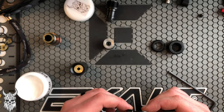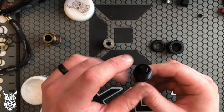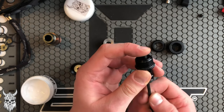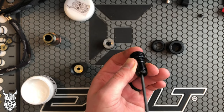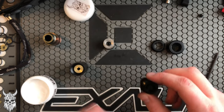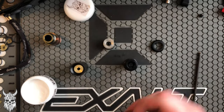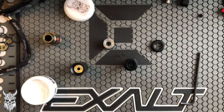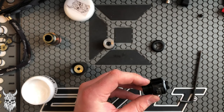And we'll put the adjuster back in the body. Let's drop that in. What you kind of need to do is hold even pressure here so the threads can catch correctly. There we go. I'm going to bring it just before flush. Should be 200-ish. These are adjusted in very small increments, so we'll definitely gauge that before we put it back on the gun. Check for creep. Creep is when you have air leaking past the system and pressure increases in your gun, which is not good.